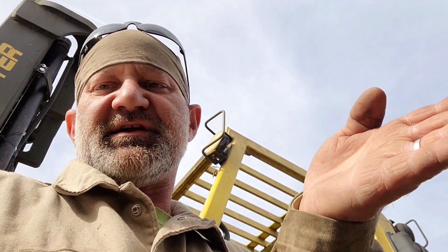You'll notice a lot of times on these welds, like on this bunk, on this log truck, once I weld a crack up, I weld a whole bunch over top of it. Sometimes a huge weld. You know, this crack is like the thickness of the edge of a razor blade, but I'm welding on it as wide as my thumb or more. Well, what I'm doing is I'm not only welding up the crack, but I'm welding over the steel around that area because I know that all the steel in that area has suffered from that metal fatigue.